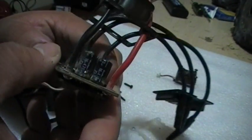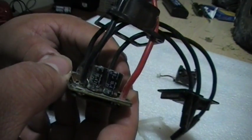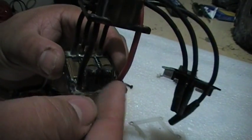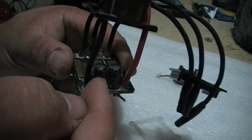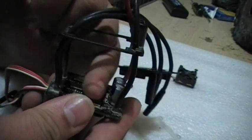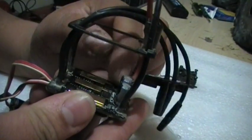So what you've got to do to actually waterproof it: you can take some Corrosion-X, or you can use Plasti-Dip, or you can use Shoe Goo. What I do is I'll actually spray some Plasti-Dip in here into the crevices underneath the caps. I'll mask all this off because you don't want anything on the actual MOSFETs or the heat sinks — so from here forward would actually be covered in Plasti-Dip.